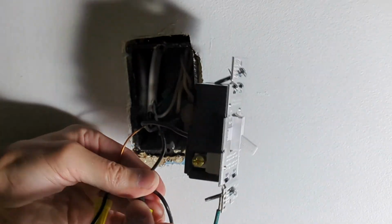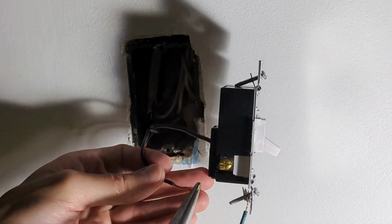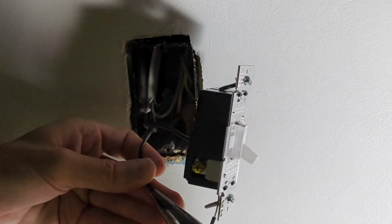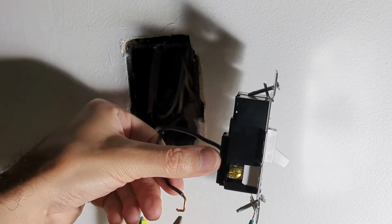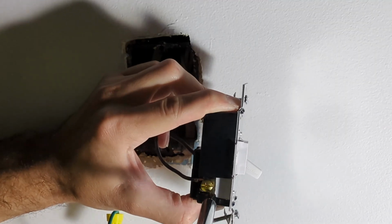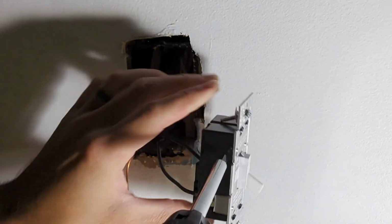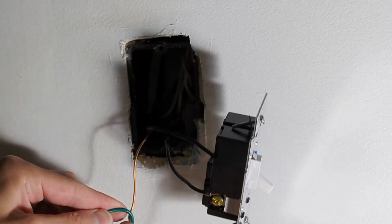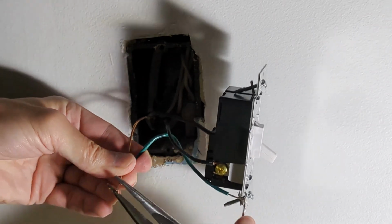You got the other wire. Same thing, this is going to wrap around the screw in the direction that you tighten it. Depending on the condition of the wire, you might need to cut this and strip the wire back. Tighten down this screw. And finally for the ground. For that, 2 wires going together. First, good practice, you twist the wires together first.